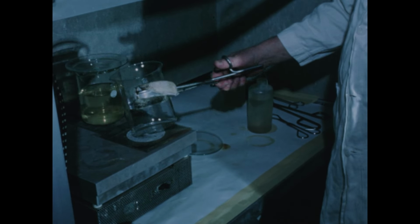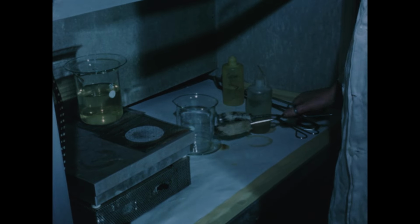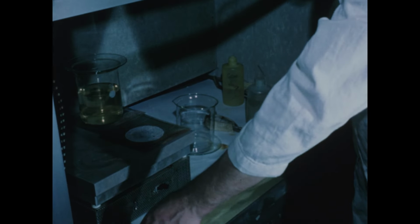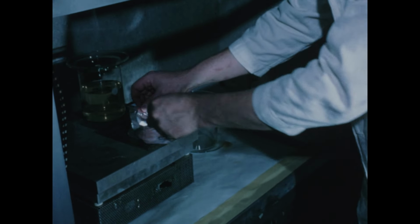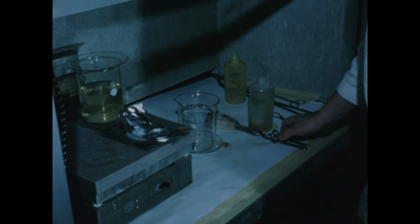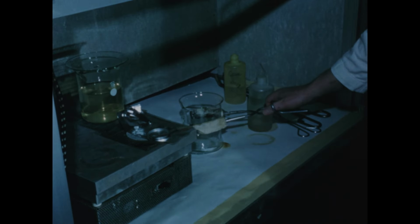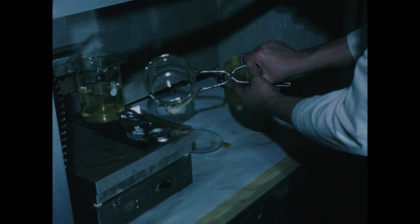If radioactivity and chemical purity are within acceptable limits, the water may be reused by transferring to the condensate storage tank or directly to the shield water system. Unsuitable water, if within limits for discharge to the environment, may be discharged overboard. If not within limits, it must be reprocessed before discharge.